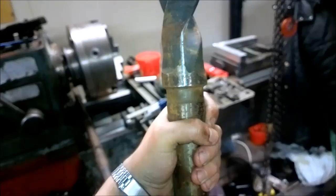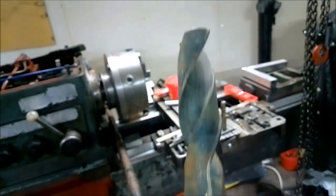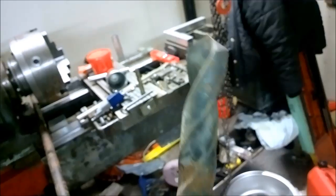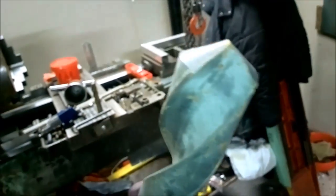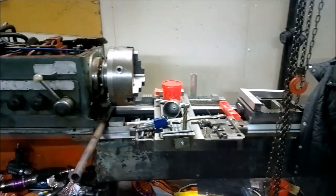I really recommend this. It's not all that useful with aluminum because it's soft to drill anyways. But when you have especially a bigger lathe and you're drilling with a drill like this — this is a 56mm drill, about two and one eighth inches, Morse 5 — when you're drilling with a drill like this in steel with low RPM, you can just leave the drill drilling and maybe do something else meanwhile. So I really recommend building one of these hooking systems.